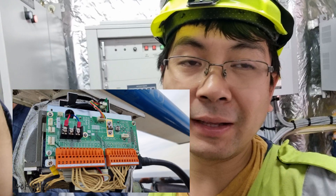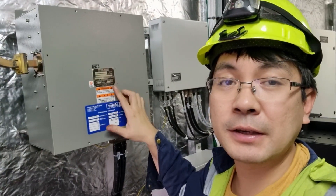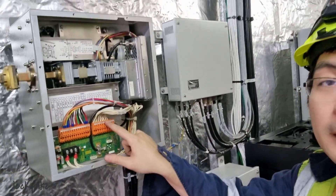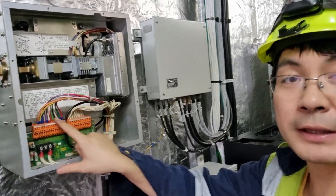After climbing up on the monkey island and checking the scanner, we found out that on the terminal block there is 12 volts going in. Now we need to check the transceiver side because we know for sure that everything is okay on the scanner itself. So we now move to the technical troubleshooting part, which is to go to the transceiver. This is the transceiver box and we will open this and check the voltage of this terminal block.